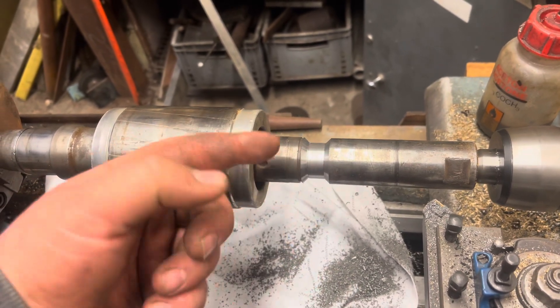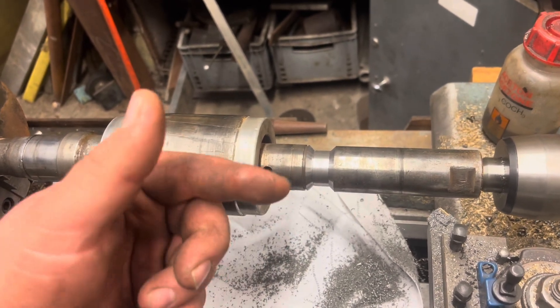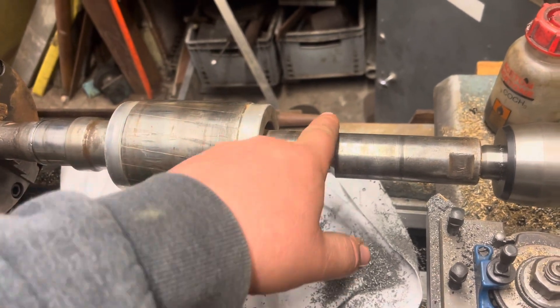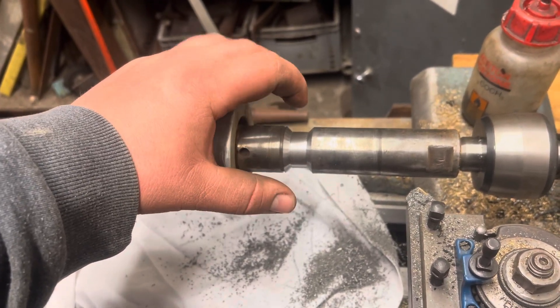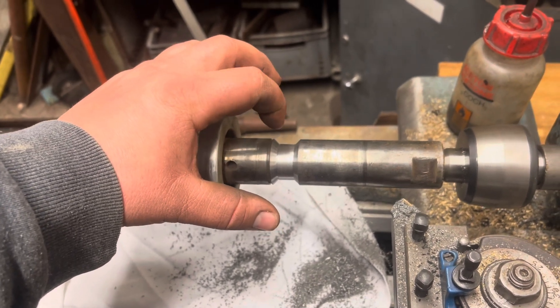The machine in question is some sort of diamond grinding machine. I saw the wheels — they look like a coring drill, about 60–80mm long, coated with diamond on the outside. They sit on an arbor, the arbor's got a taper on it, and the taper goes into the opposite end of the shaft to what we're looking at at the minute.